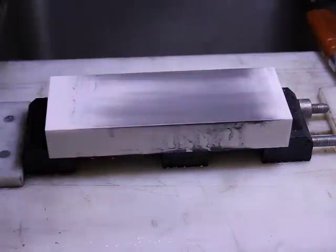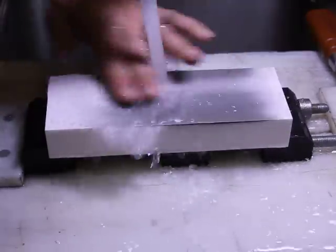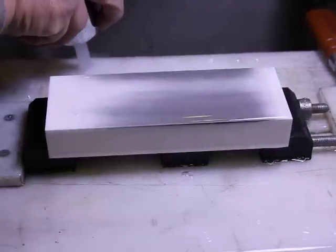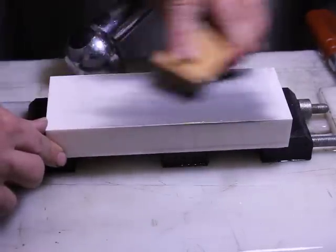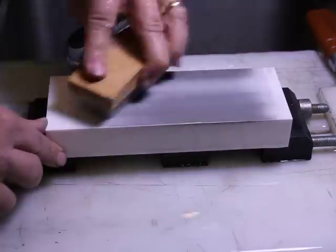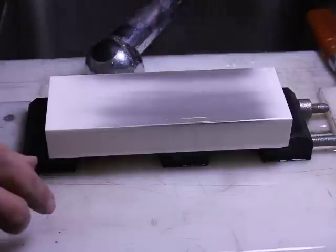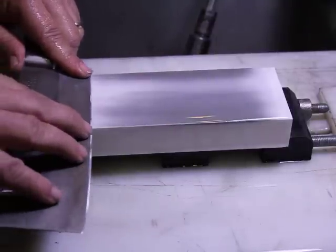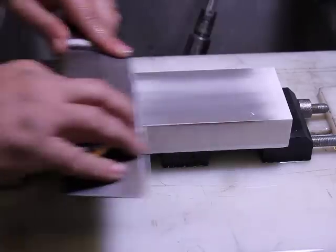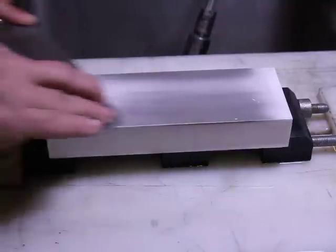Let's give it a nice rinse just to see how well it holds on to the metal swarf. It does seem to hold on to it fairly well — sometimes more so with coarser grit stones. You can take a little brush and scrub it to reduce some of that swarf. Ultimately you can either lap the stone or use a mild abrasive stone. For something like this I would use something like a 1200 Atoma to take a little of that off. At this point it's a very light amount of swarf and doesn't interfere at all with the performance of the stone.